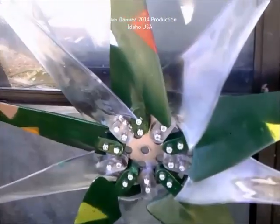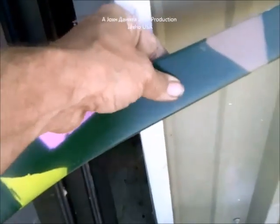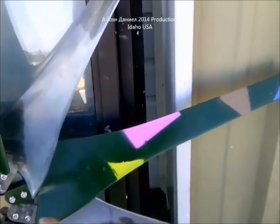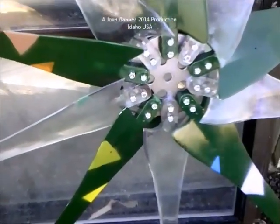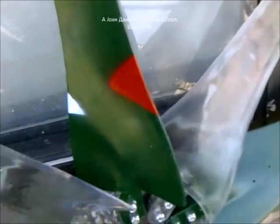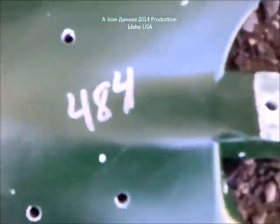I don't think they're a bad design - I just think they're really poor quality plastic. The company that makes them apparently isn't paying any attention to their actual weights or where the weight is, because these thicknesses are so graphically different. They supposedly show video of them micing them out, but they're not reading the mic in the video, and there's an obvious reason why. I think this type of plastic is a thermoplastic that might swell or contract. When you've got one at 484 and another one at 450-something, that's not good - we've got to get them closer.